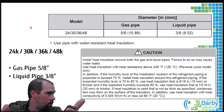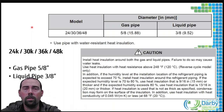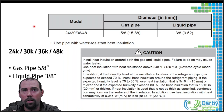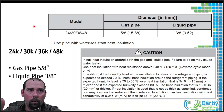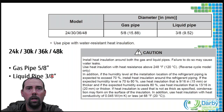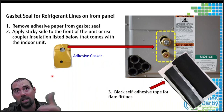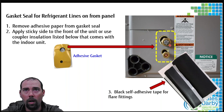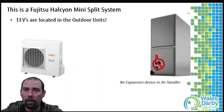Line set insulation could be a class on its own. The air handler box is completely engineered - on a horizontal left install there's not much you have to do to the box itself. The rest is running wire, copper line set, and ductwork - a little more than ductless but that's where most problems occur. One consistent spec across all units from two ton through four ton extra low temperature heating: line sets are always 5/8 inch and 3/8 inch. Fujitsu also provides adhesive gasket for the door and around flare connections, plus foam for extra protection against condensation.